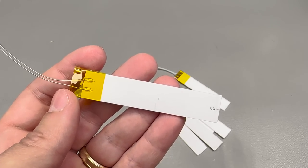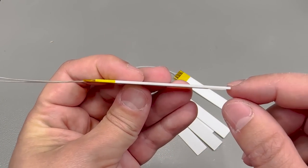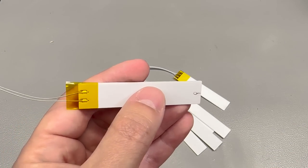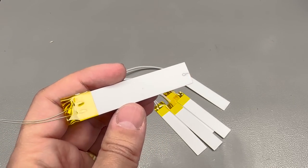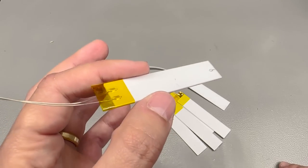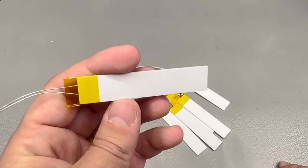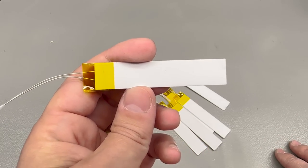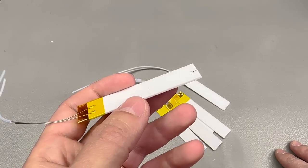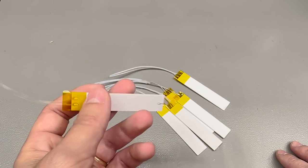Next up I have a few interesting ceramic heating plates. These come in a few different internal resistance values — I ordered variations of 2, 5, and 10 ohms. The size is 15 by 70 millimeters, but you can also find them in other sizes. They are rated for up to 500 degrees Celsius, and the seller also claims any voltage up to 100 volts is fine, but without a datasheet we don't know if 100V is close to a breakdown voltage or if they can handle 240V — they mention 220V example calculations in the description, so it's not clear whether it's safe to power these off mains. I don't have anything specific in mind for these, but ideas could include a small soldering hot plate with a PID controller or maintaining temperature inside an electronics box in harsh weather. I invite viewers to suggest other applications in the comments.